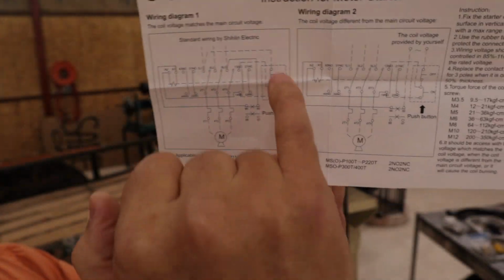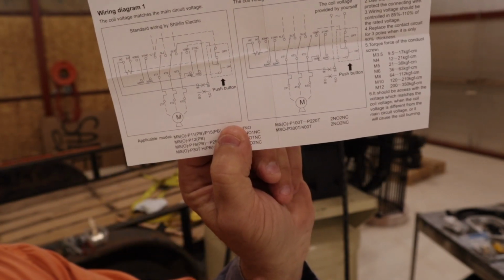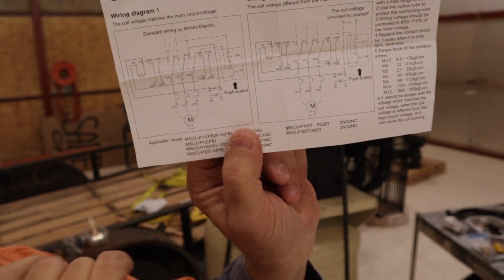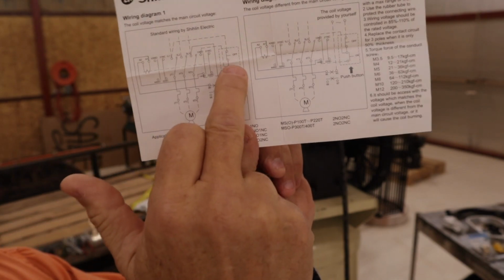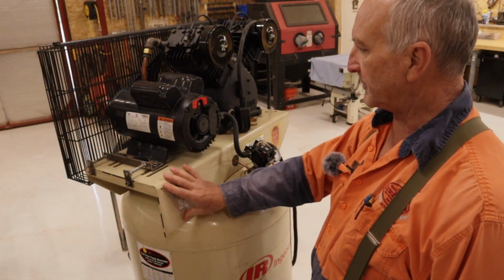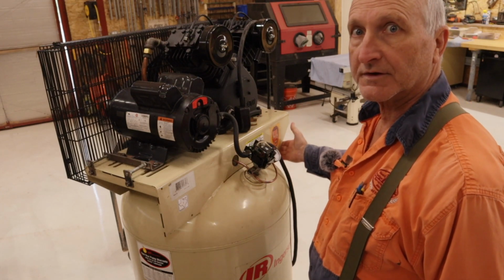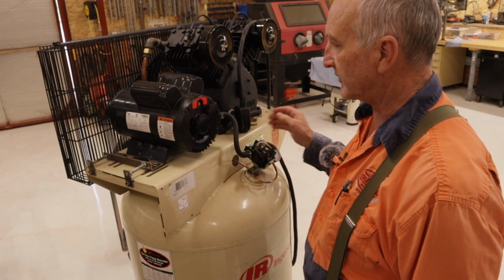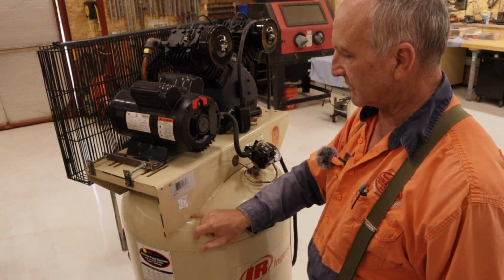Diagram number 1 shows an on-off switch here, which is a momentary start, and then it's got another button that you press off, and it de-energizes the contactor. But in this case, I'm just replacing this with the switch over there. If you look at this mounting plate, you'll see this is a square corner. All the other corners, like this one, are angled off at 45 degrees, that corner to that corner. This was meant to have something mounted to it. It's even got holes.